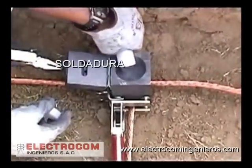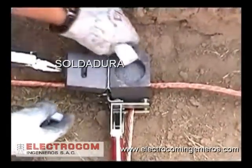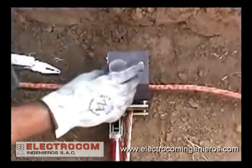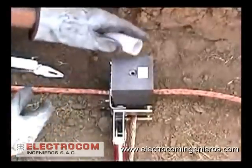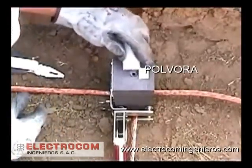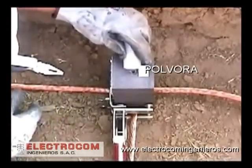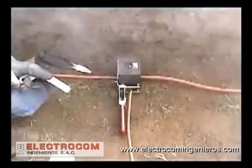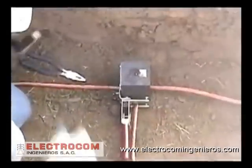Then open the proper container of weld metal and pour it into the mold. Close the lid. The starting powder is located in the bottom of the tube. Tap the container to loosen it and place about 25% of it into the Easy Light ignition pocket. Now, using the flint igniter, ignite the starting powder. Wait approximately 15 seconds before opening the mold.